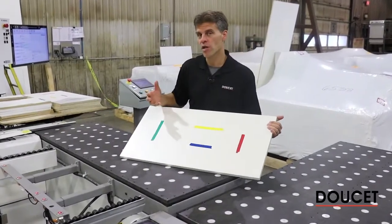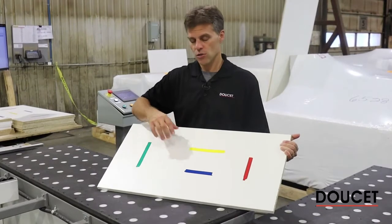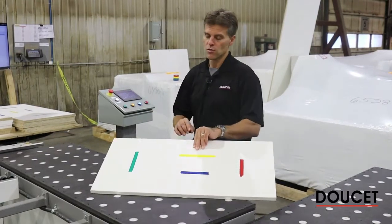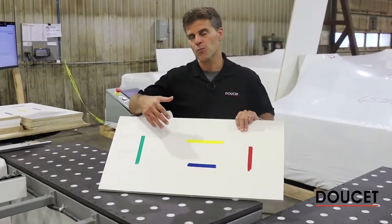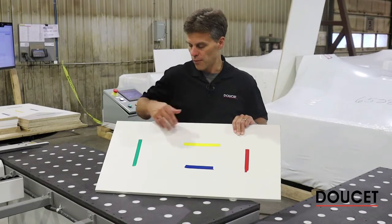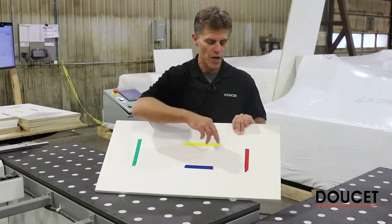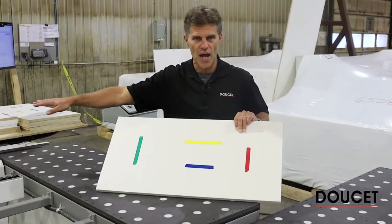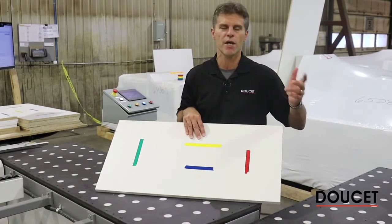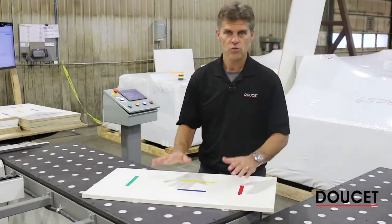For this video demonstration, on each panel we've put color signal tape — those colors refer to the same color signals on the bottom of the screen. Because we've programmed a specific recipe, we want to be very visual in showing you if we're following the tracking of the part. Every time we pass a green tape it's going to turn the same way, and every time we do the red tape it's going to go to stacking with a different rotation. We're going to run the system in batch mode and independent mode as the video progresses.